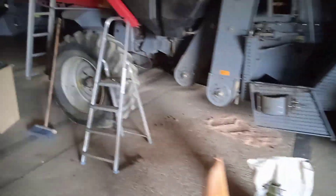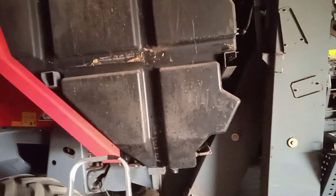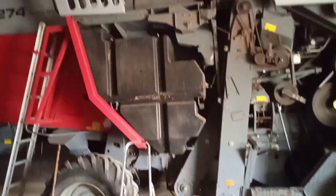Let's have a quick look at what we've got here. From the bottom of the tank we've got must be 20 millimetres to the outlets, so you've got that bottom section there that could collect water - but there wasn't a drop of water in it. Either way, there's a little bit of crap in the tank right at the very bottom. I think we'll still take it out and steam clean it and dry it right out - put a fan in it or something - and then put it all back. Hopefully that'll cure everything, with fresh diesel obviously.